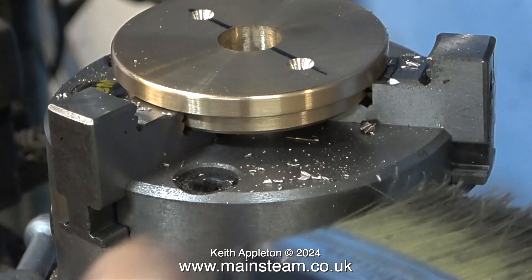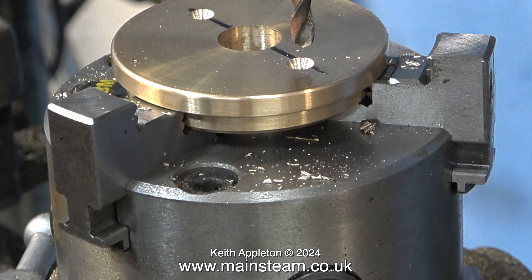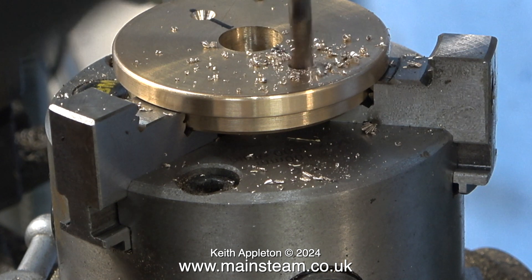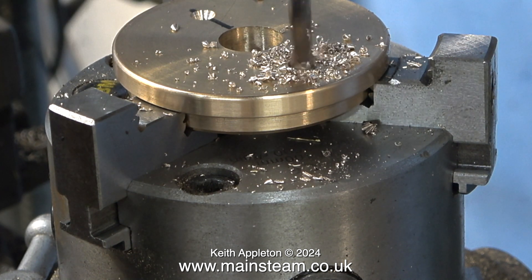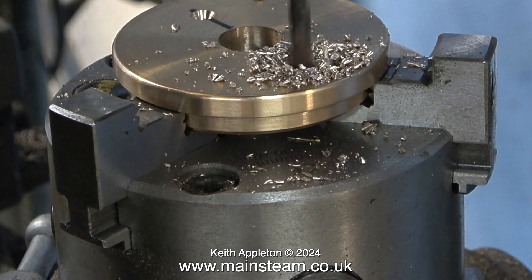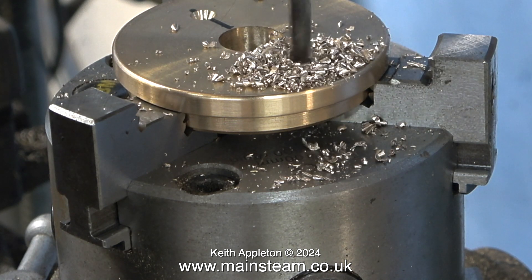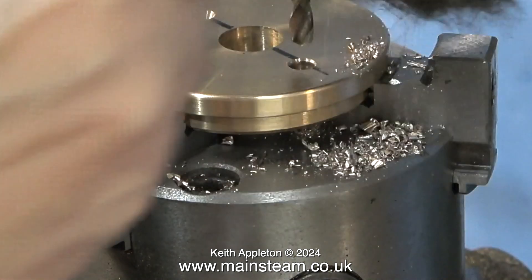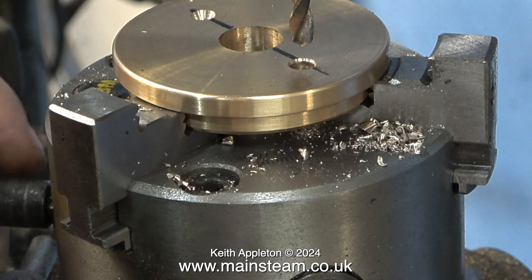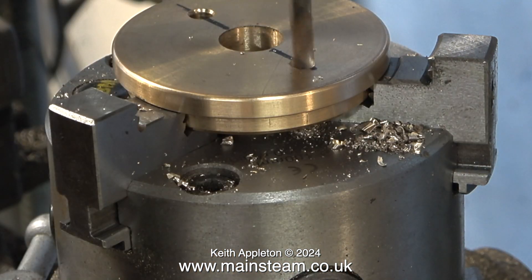At the 180 degree point I'm drilling the other hole with a center drill. I brush away the swarf and fit a 7/32nd of an inch twist drill bit into the chuck — that is tapping size for quarter by 40 threads per inch. I'm drilling the hole all the way through, taking my time particularly as the drill breaks through because I don't want it to plunge downwards into the chuck. I really should have used a piece of mahogany underneath where the drill breaks through to stop it hitting the chuck, but thankfully it didn't anyway.